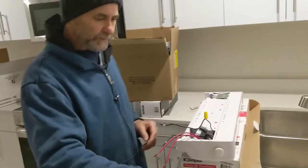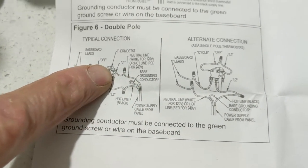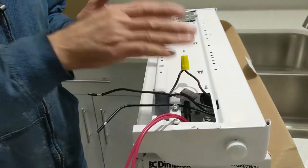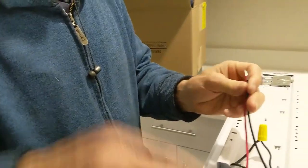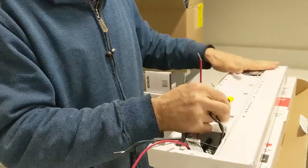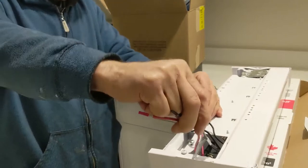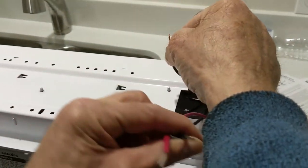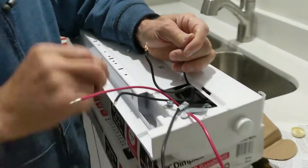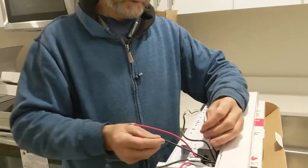Now for the wires — we follow the instructions here. Power comes in on these two, you connect the ground there, then the last two go to the thermostat. What I'm gonna do is connect these two here together, that way it's easier when you connect to the heater. Both sides are the same connection — these two go through the thermostat, the power connects on these two from the wall, and these two go to the heater. The two phases are hot and they go to the thermostat — we just do two and two, nothing to worry about much.